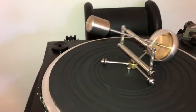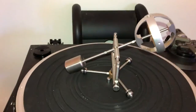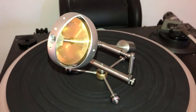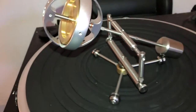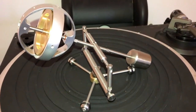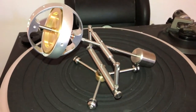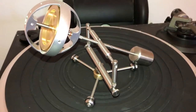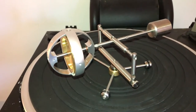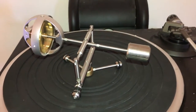This is deliberately set to precess. I just want to demonstrate how you can see the precession change simply from the torque that gets applied at the base when I rotate the turntable. I'm going to cut and spool this thing up again. I'm back, and as you can see, the gyroscope is precessing in a clockwise direction due to the torque induced by the counterbalance.